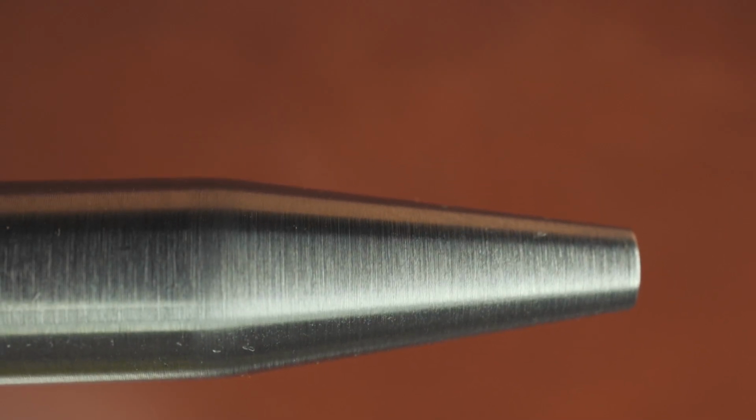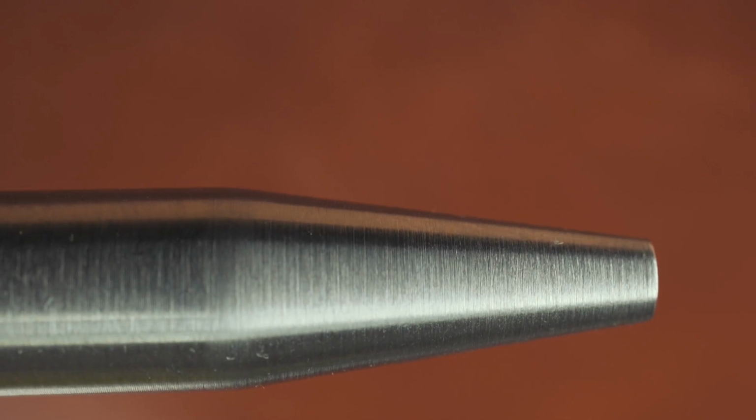What I love most is examining the brushing under the macro lens. You can see some angular uneven striations. This is a key indicator to me that the brushwork is hand finished, with what appears to be a 180 grit emery cloth for number 4 finish. I love that. Combining high-tech CNC machining with old-school hand finishing just shows a ton of care to the craft. In short, overall, manufacturing-wise, 10 out of 10.